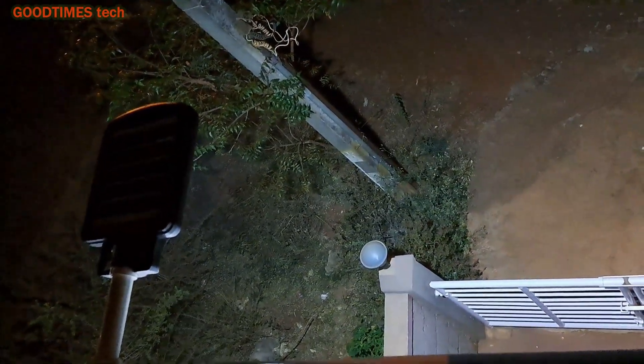According to the company, six to eight hours of bright sunlight charging will make the streetlight glow for one to three days depending on the mode of usage. In automatic mode it goes to 10% brightness and senses any movement — even from the backside — and goes back to 100% brightness. I tried two angles: one parallel to the ground with LEDs facing downwards has less street coverage, while a 45-degree angle using a 1-inch 45-degree shoe bend covers the street much further. The main drawback at 45 degrees is that if fixing it facing south, east, or west the battery will not charge fully. Only if facing north can you use this angle. If facing south, east, or west, better not to exceed 15 degrees.